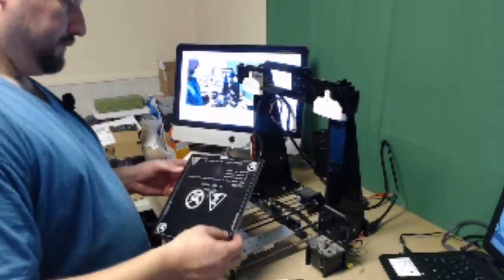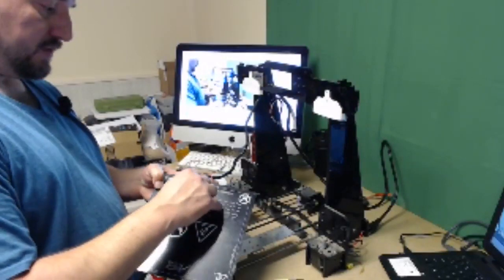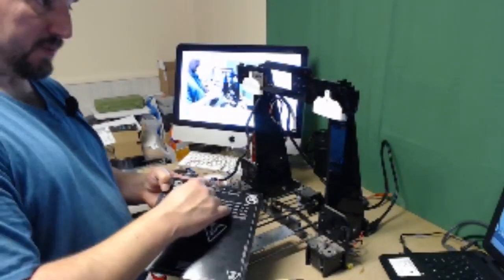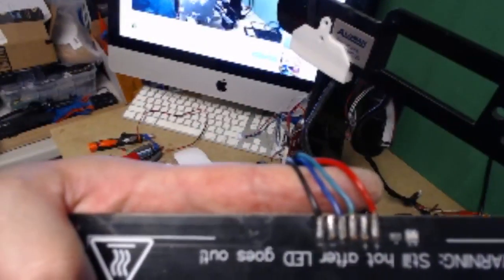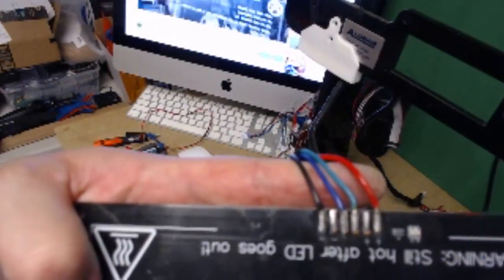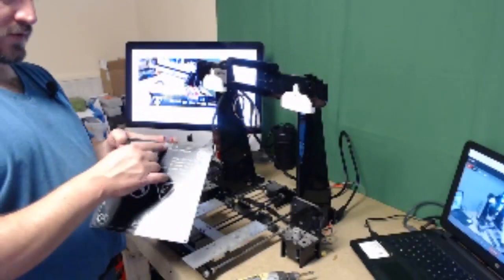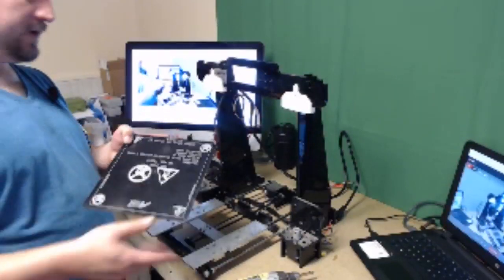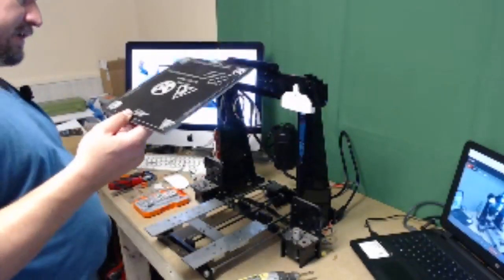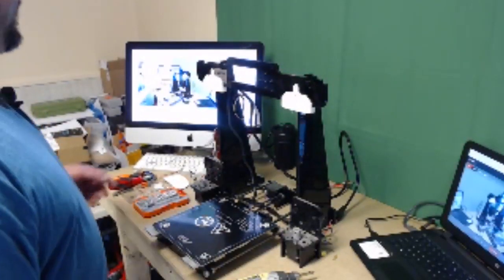Anyway, yeah, I applied heat to each one of these and I pre-soldered them. So I added flux and then I soldered them using a really old soldering iron that everybody said would not work. And I think that did work. Does that look like it worked to you? I'm going with, yeah, that worked. So for everybody that said it wouldn't work using an old soldering iron, I needed to have something that was stupid hot. No, you just have to have patience and don't move your soldering iron and keep heating this thing because it does dissipate heat. So the only downside is that now it's attached permanently. So that is something I'm going to have to do.